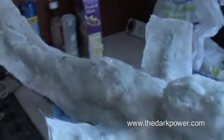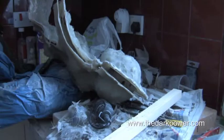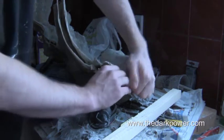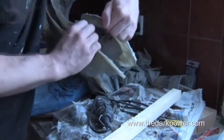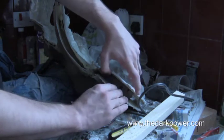So we've now finished the mould — both halves, there's the back half. I've just cleaned the edges up slightly with a Dremel; you do get some quite sharp spikes sometimes with the resin. What I'm going to do now is literally just crack it open, and that really involves just driving a screwdriver between the two layers and slowly prising it apart. You can see the mould slowly coming apart — it's just really a question of slowly easing it out. Obviously the sculpture gets destroyed in the process of pulling it apart.